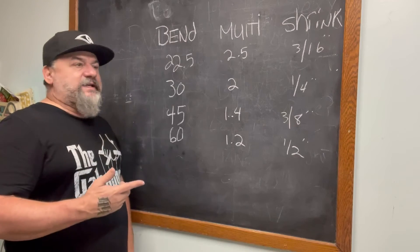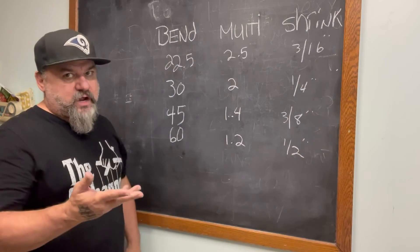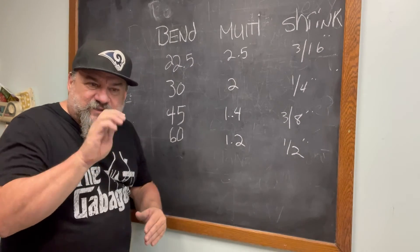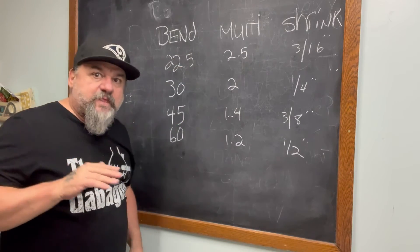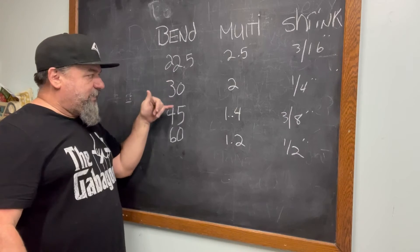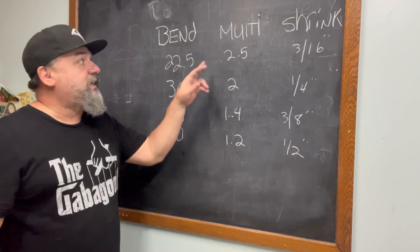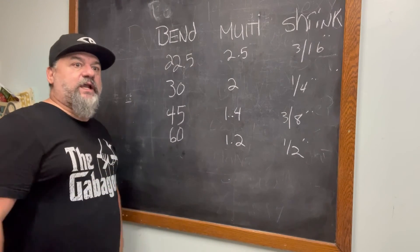Screenshot that, write it down. I usually use 30-degree bends for most of my pipe bends because it's a nice round number — 30-degree bends for all the offsets. 45 is tighter, so it's harder to push wire, and if you have a few of them it makes for a pain in the neck. 22-and-a-half is more subtle. The higher the numbers, the sharper the bend. The multiplier for 22.5 is two and a half — not too hard to figure out. Pretty quick and easy. You know what I'm going to do — taco time. Thanks for watching, subscribe, like, hit that thing.